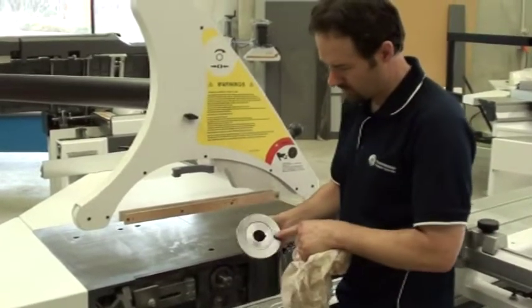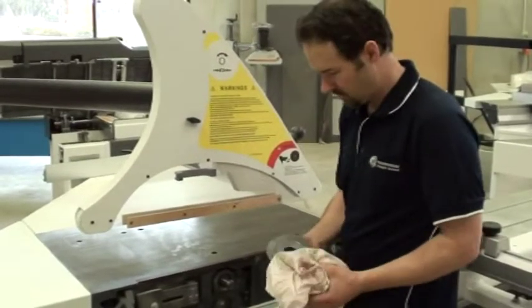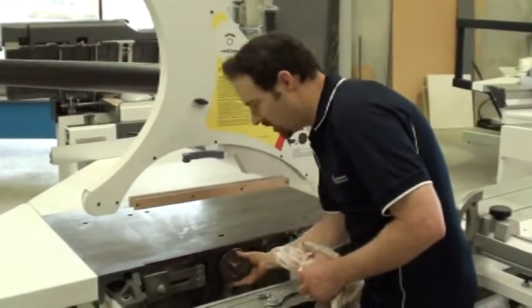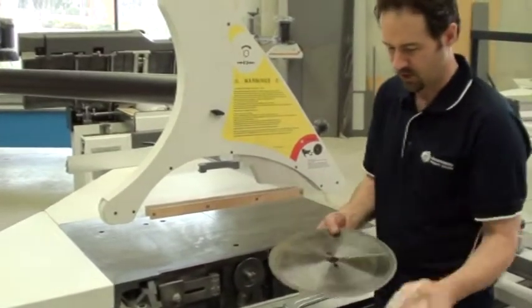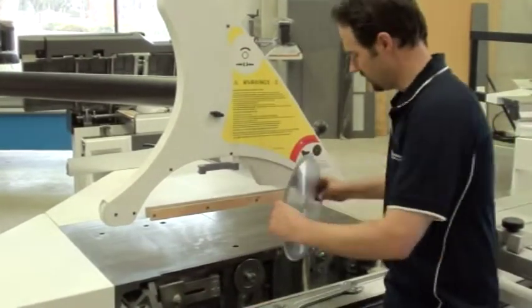So it's very important to make sure the flanges are very clean. If there are any contaminants on there that won't wipe off with a rag, just use some steel wool or some very fine emery paper, of course. And not only do you need to make sure the flanges themselves are clean, you want to make sure the blade itself is squeaky clean. Either one of those two things can throw the saw blade out.